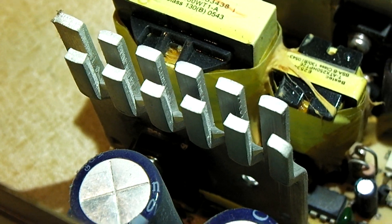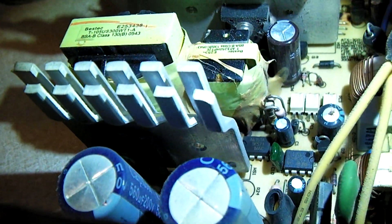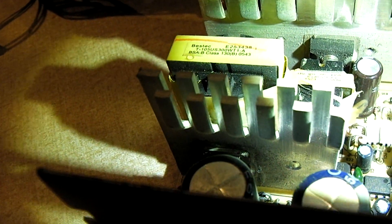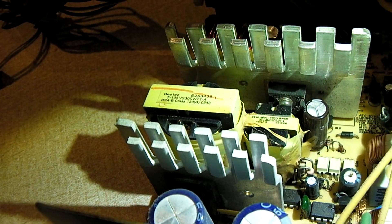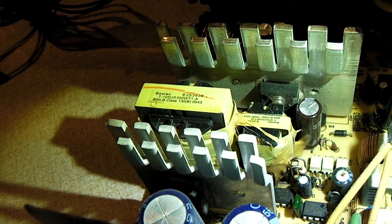This thing stinks — it really just stinks. It's been about five years or so since I've had a power supply explode on me like this. You can see that spot of glue right there where it goes down toward the IC. It's dark right there, but I don't think that was actually the failure spot. The fault seems more around that 5 volt standby transformer. I may follow up with a later video where I tear this thing apart and desolder that 5 volt standby transformer so we can get an idea of exactly what shorted out.